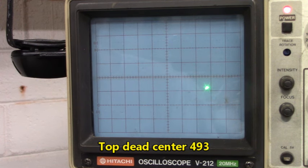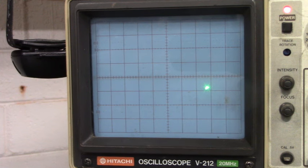And the other seven pulses, that we didn't make it to 500, were because I miscounted. So this is a 500 pulse per revolution encoder. I had never done that before. That is all right. That's one way if you never know what the pulse count of an encoder is.